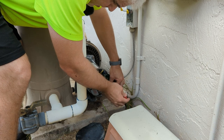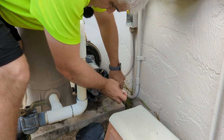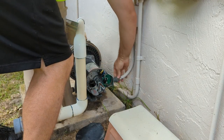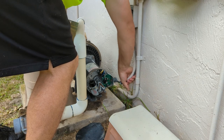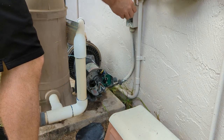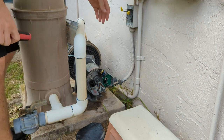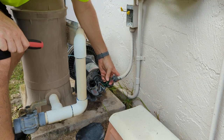So I was speaking to the homeowner and he elected to just replace the motor — he doesn't want to deal with replacing bearings. I'm going to respect his wishes and replace the entire motor. But I do have the old one, and I think I might try replacing the bearings in it anyway just for fun, to show you the procedure in case your motor isn't that far gone. If you get to it in time, quite often you don't have to replace the whole motor. This is also why I was going to replace the wires — these don't look so hot down here.